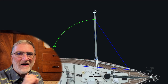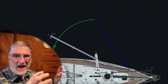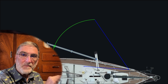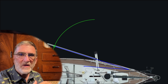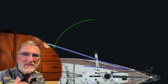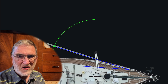When a pole is back-winded, it rotates around the swivel attached to the end of the short pole. As it swings back, the foreguy starts to stretch longer and longer until it gets to a critical point. From there on, the foreguy stops pulling the pole forward and starts pulling it toward the side of the boat. Depending on the exact setting of the topping lift, the pole will hit the rub rail, the life rail, or the mizzen forward lower shroud.